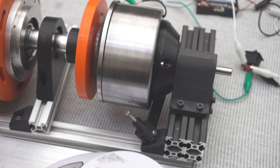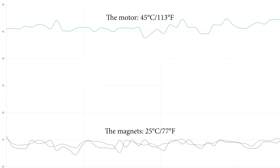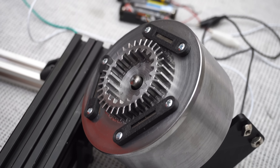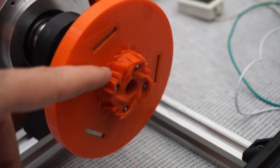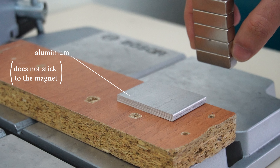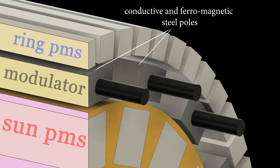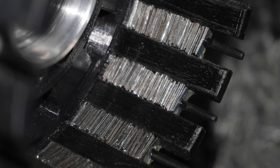When there was still no change in temperatures, I doubled the battery and increased the torque load to 4.5 newton meter — a considerable load, as much torque as the motor I use in the lathe. After a total of 20 minutes, the magnets in the ring gear heated up only slightly to 25°C while the motor was around 45°C. However, due to friction the steel disc and magnet of the brake heated up incredibly. So no heating issues with the gearbox. There should be some heating because when a permanent magnet passes near a conductive material it changes the magnetic field within that conductor, and a consequence of this is the formation of eddy currents which cause heating.